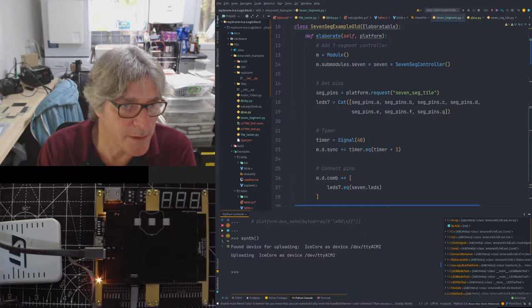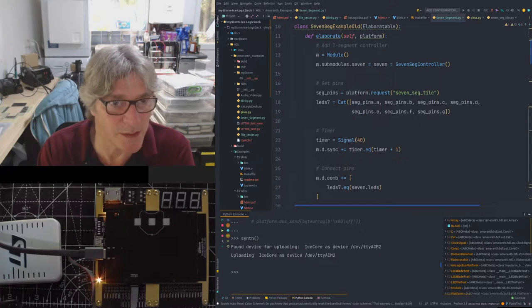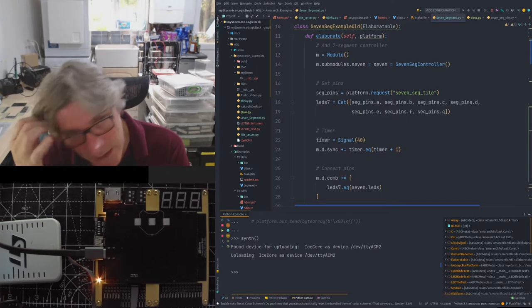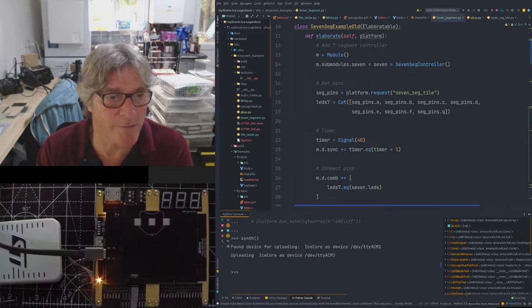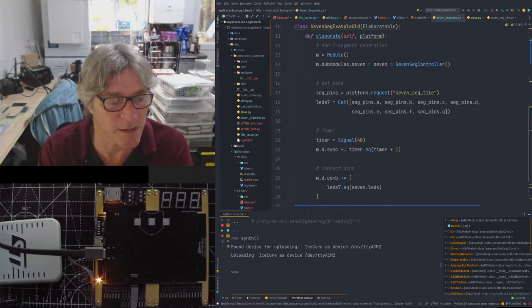Lois said, do you mean using Python-based Amaranth on the FPGA or just using Python client host? Ipo says, I was just talking about using the synth command in Python versus the serial port, but I'm finding what he's covering interesting as well. Just wasn't sure what would be available for configuring the FPGA. Wasn't sure if serial was still deprecated, but now I know. Yeah, both are still there. It's backward compatible. By doing the Python stuff, we're building a layer above that that makes it easier to integrate, particularly when it comes to things like Amaranth and testing.